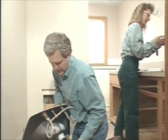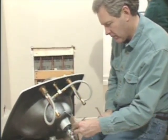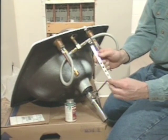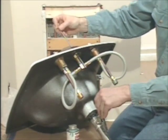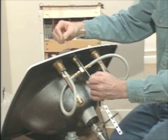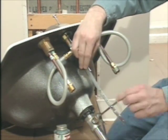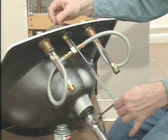The last thing on our drain assembly is the stopper. We want to take this collar and screw it into the hole on the side of our drain tailpiece. It's kind of tricky connecting the handle, which I'm sliding through the top of the spout, and our lever. We want this handle to move freely, and we want the stopper to move all the way up and all the way down. We'll start with it in the fourth hole and see how that works.